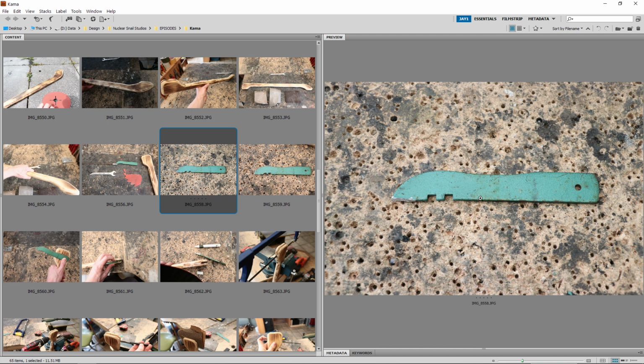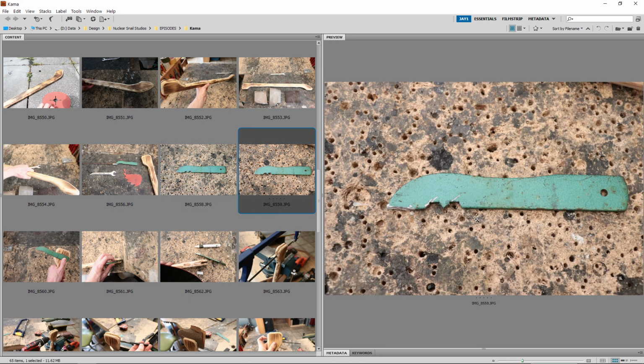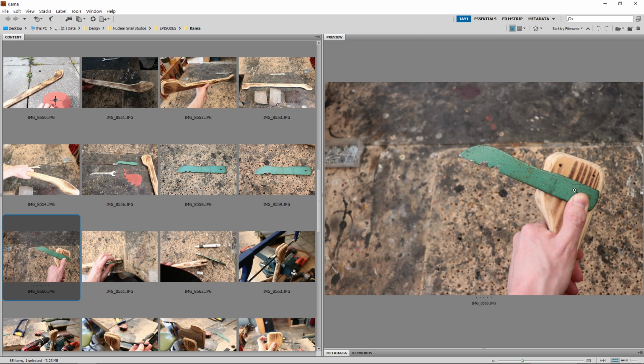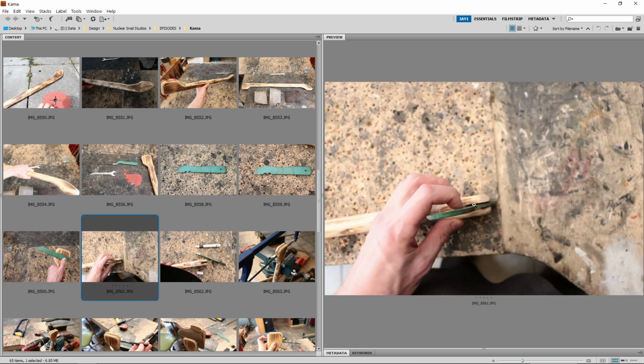It reminds me of a mantis because of the color and because of this sort of serration-ish thing, which I then, using again the rotary tool with a metal cutting disc, make more sharp and more aggressive, as you can see here, instead of it just being square. So I hold it to the piece and consider how it will go in. As I've said, I need another slot for this because, as you can see here in the original wrench slot, this is too thin. I think it's like a millimeter thinner.